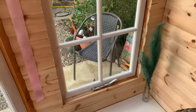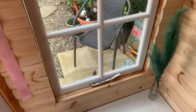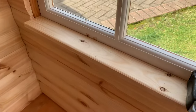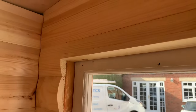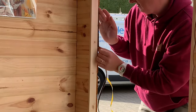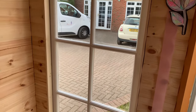Good morning - I'm back again and in the meantime it's been decorated. What a lovely little space! The last thing to do to make this winter proof is to seal up the windows - you can see there are some great big gaps running up the sides. We're going to create an internal frame around both windows, put some draft excluding tape on and make it more airtight so we don't get howling draughts in the middle of winter. The bottom strips are slightly larger to act almost like a window ledge, then we have strips going up the sides and a strip at the top, all with airtight seal on the back - one edged off sealed window unit.